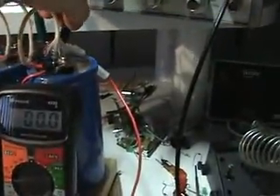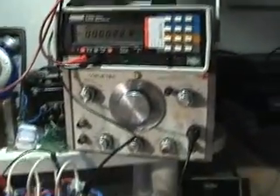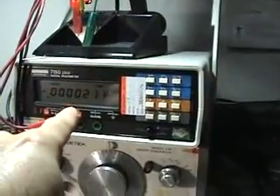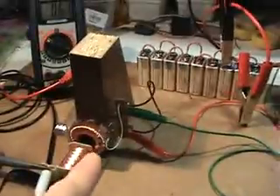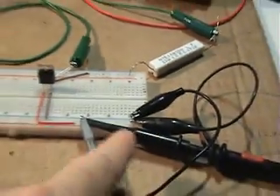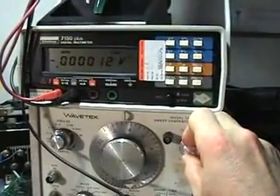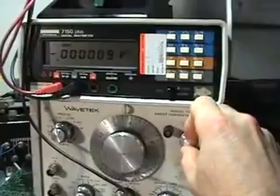I'm reconnecting here to measure our voltage across our precision resistor. As the voltage is climbing on the capacitor bank without the battery connected, the circuit characteristics change. So you have to continuously be doing some microtuning as this voltage goes up to keep the resonance happening and get the optimum effect. There's another thing that could help: the amount of voltage being sent to the MOSFET gate. If I start increasing that voltage — increasing the output of my signal generator — see how just increasing it a bit has changed the amount of energy that is being collected.